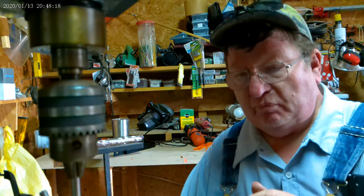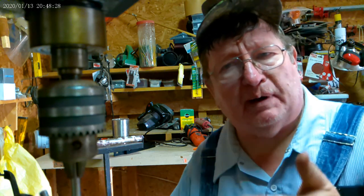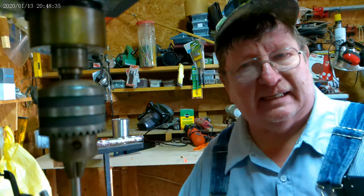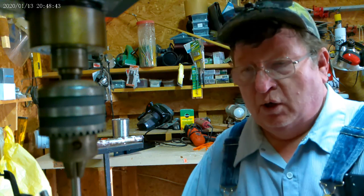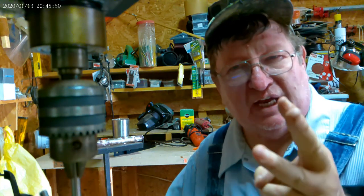Could I have taken a bigger bite? Yeah, I could. I actually think I could have taken a lot bigger bite. But I just machined off like a 1/16 of an inch per pass on that brass piece, and I machined off about 1/8 of an inch of the plastic per pass. So now, the next video, we will put a vise on here and we'll try it on copper, aluminum, and steel.